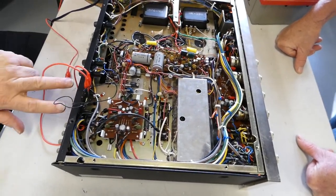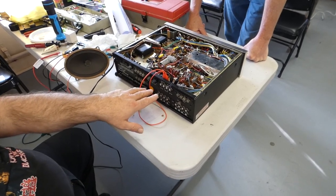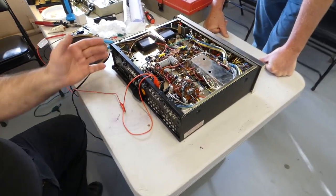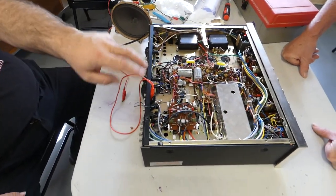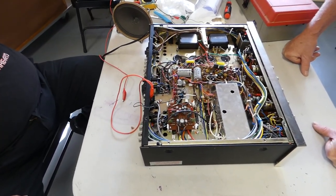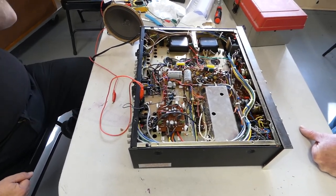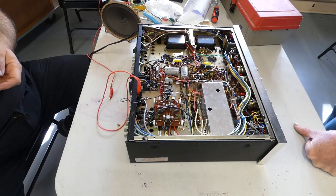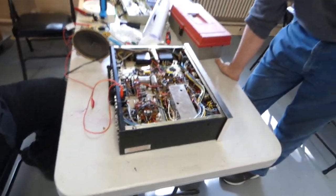We're using these jumpers as bus bars because the equalizer's not here. When you have your equalizer, your preamp to main amp out goes through your EQ. When you don't have that, it comes with little bus bars that jump in your center taps and complete the circuit. Everybody wonders what that bar is for — you pull it out, the whole thing goes, nothing works.